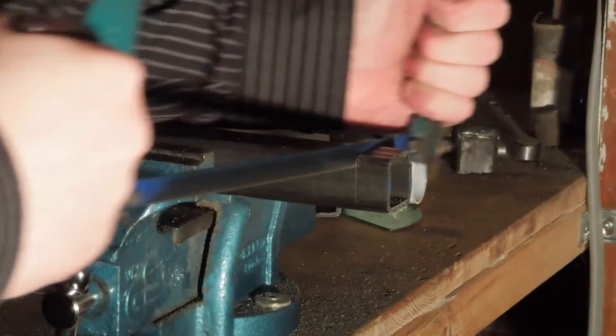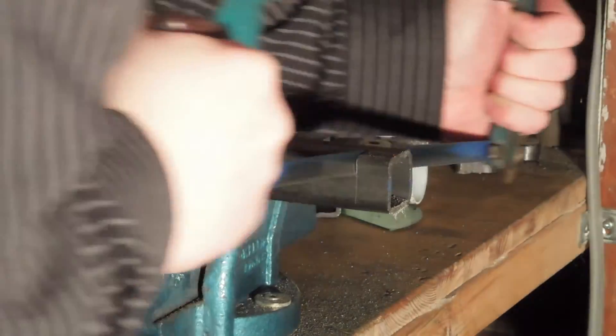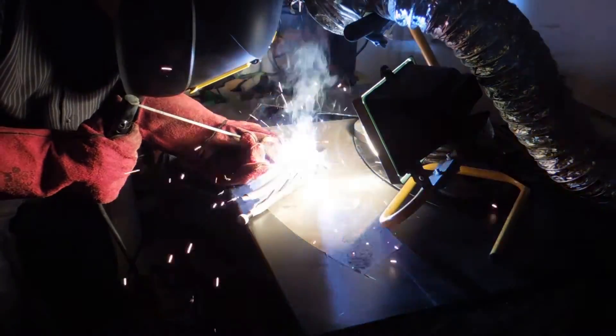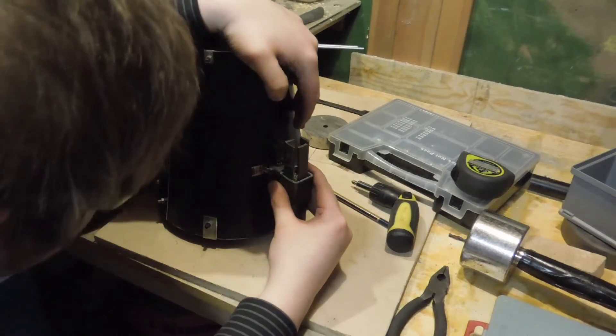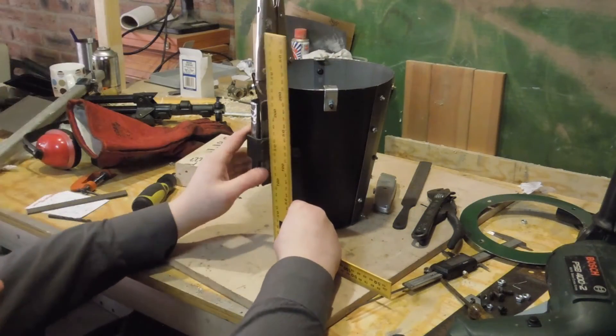Next was the part for mounting the cone to the frame. I started off by cutting some small bits of steel box section and filing them square. This part needs filing to an angle to match the cone. Then I welded on tabs — a little bit of box section with strips of steel welded on the inside, which fit the arm. The two halves are now plumb enough to weld together, then it took a bit more fiddling to attach the whole thing to the rest of the cone.